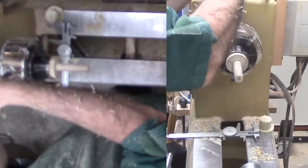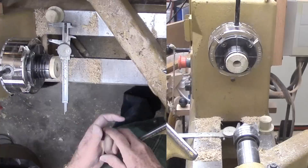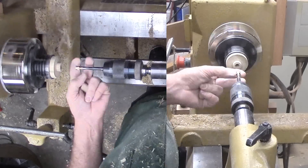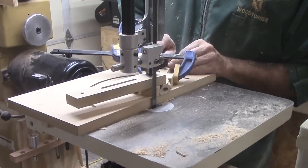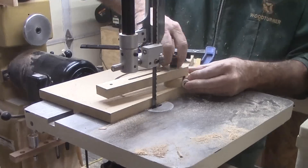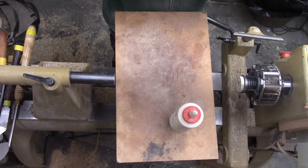Perfect. By inserting the spindle into the collet chuck, I can round over both ends of my spindle. Then reverse the spindles and drill out the middle — this will make the heart a bit lighter. Now to test my bandsaw sled. The place for the cut is a challenge since the spindle is so short, so the sled did not work exactly as I had planned. However, it was close enough that with a little scrap veneer, it did the job. I still don't know what angle I used, but at least the angle is consistent due to the angle arm of the sled. Then a quick sand to clean up the gluing surface, and glue them together. After which, I can sand the joint to clean off excess glue and any mismatch in the wood.